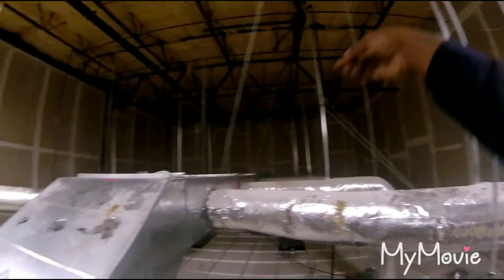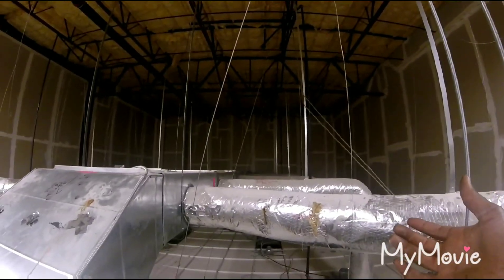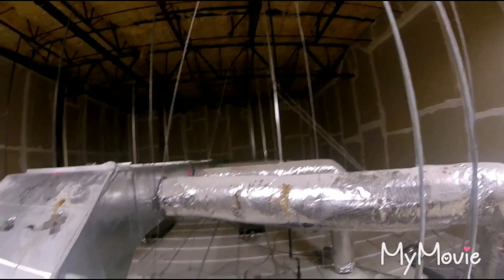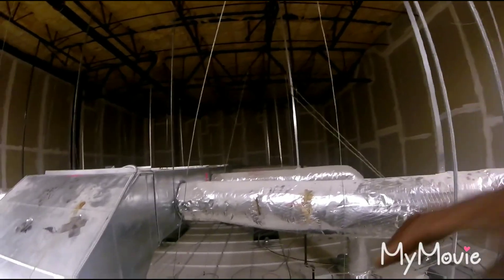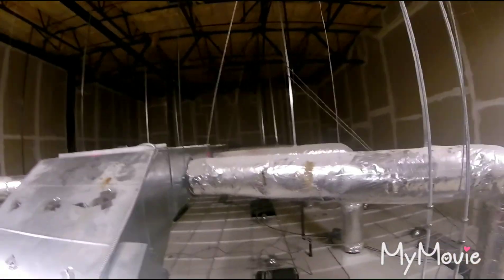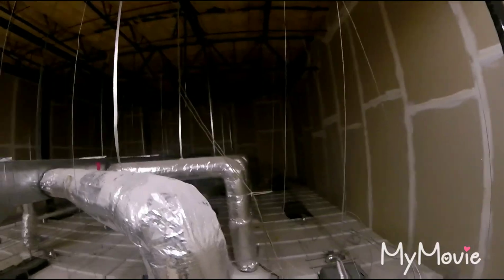You can have a kink somewhere in your duct, or the duct can be broken and all the air is going into your attic or your space. So by reading the plans, say you have ten supply diffusers on your plans but when you come to the ductwork you only see eight. The plans show ten where the engineers drew it up — so you're supposed to supply 1750 but you only got eight diffusers. Each supply diffuser will have more CFM than it's supposed to, and that can make the space uncomfortable or cause humidity problems.